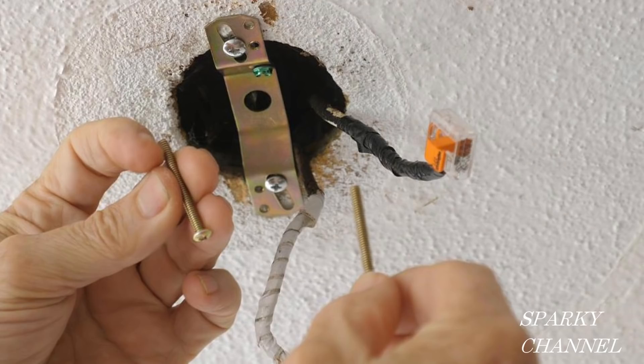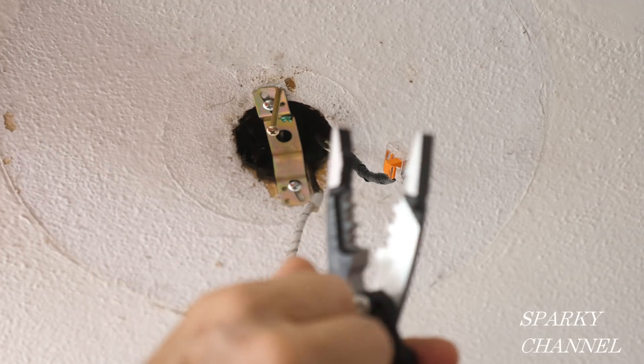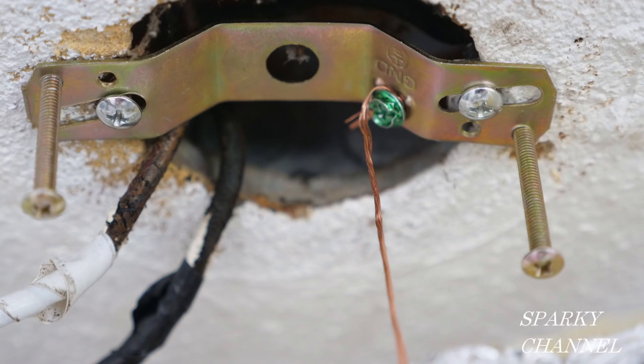Next we install the light mounting screws, but because this is a 1957 house with very small boxes, these screws are going to run straight into plaster when tightened. My solution is to use a pair of wire strippers that have a screw-cutting feature and cut the screws down so they're just about an eighth of an inch longer than needed. When tightened down they'll go into the plaster about an eighth of an inch, but it won't hurt anything and will secure the light very well. I cut about a quarter inch off each screw.